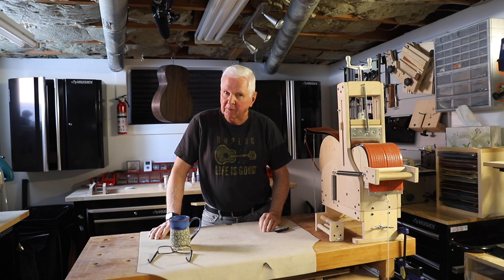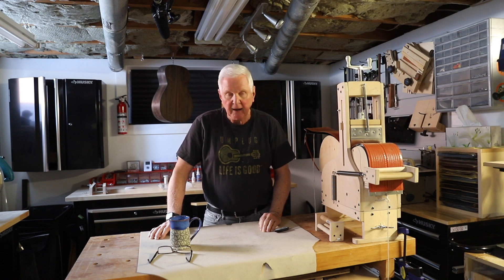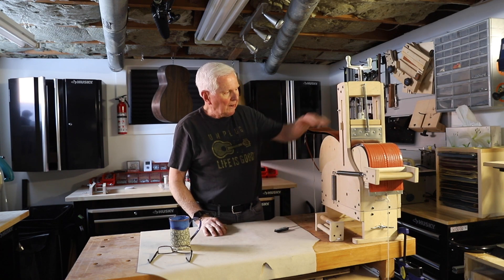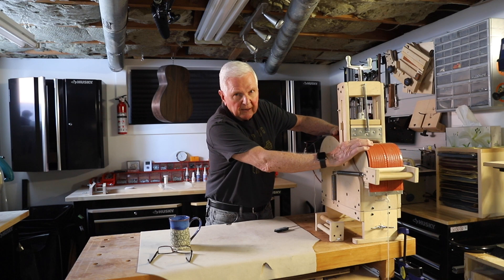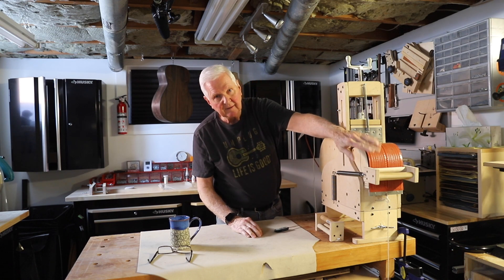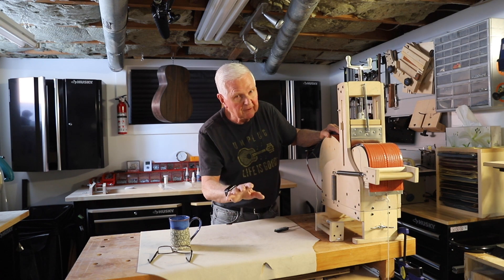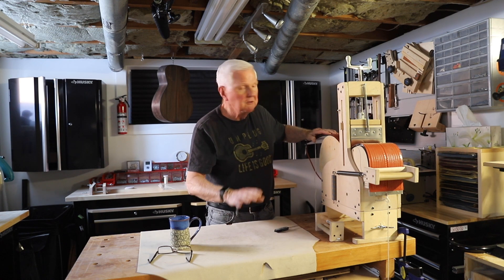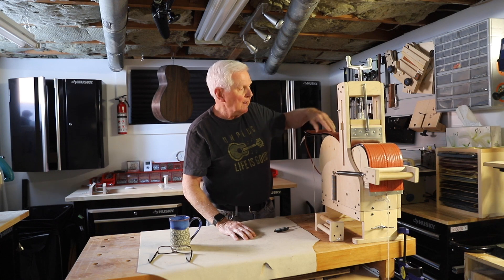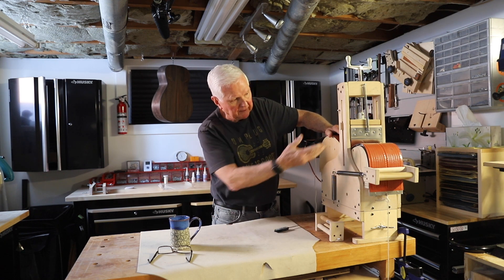We are back. The other night I had trouble sleeping so around 1 o'clock in the morning I gave in, got up and came down here to the workshop. I'd planned to show you this but we're going to go to part B — I was going to show you how I put it in the bender. You've seen me do that before and we've bent this thing. What I did is I heated up this silicone heating pad to 335 degrees and I very cautiously bent the wood in here to see what would happen. I heard nothing — everything sounded perfect, everything seemed to work fine so I left it. I came back the next day and I heated it again to about 300 degrees just to reinforce the turn and to make sure that it would keep the bend.